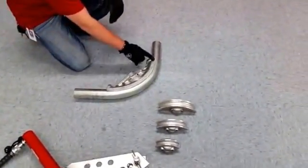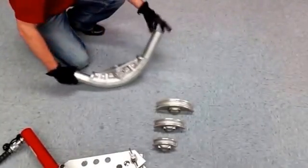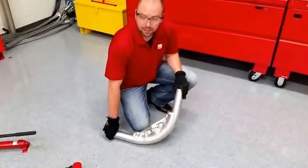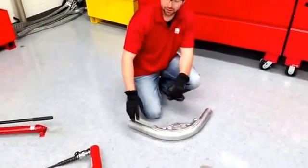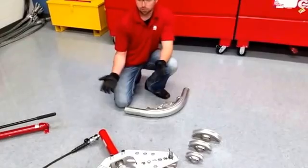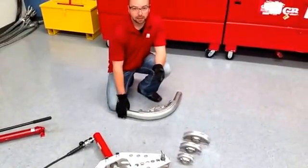The harder part is to remove the shoe from the conduit. You can either use a crowbar or a hammer — usually those are the easier ways. You can also get our eject-o-matic unit that has extra pin holes and a double-acting cylinder to help you remove it before you even remove the conduit from the bender.